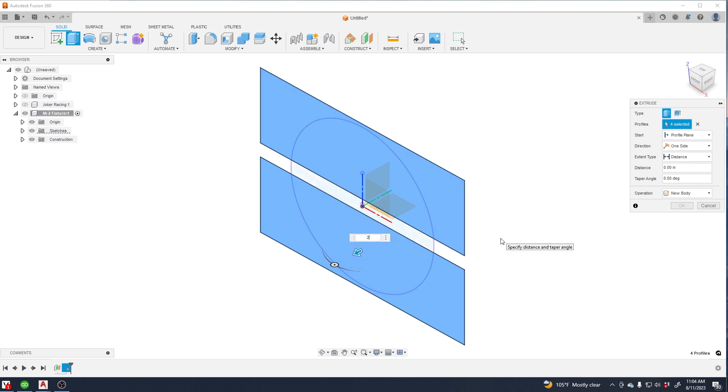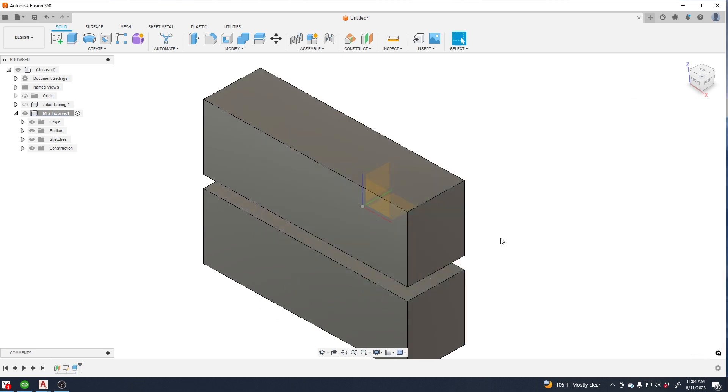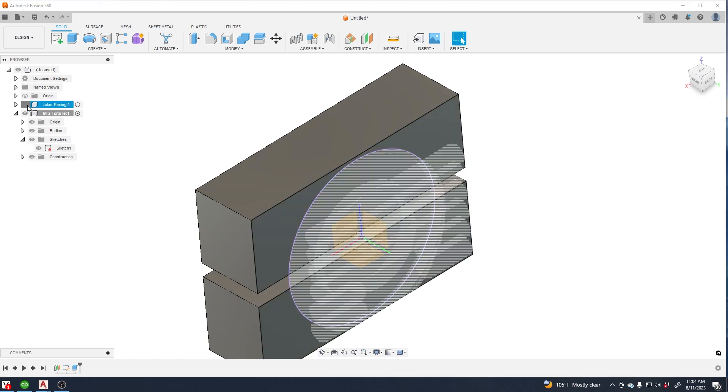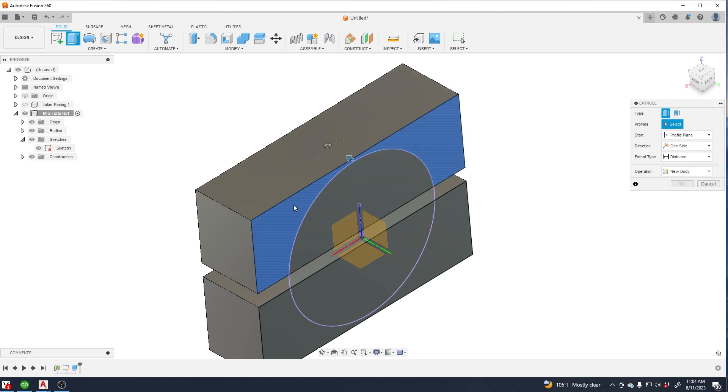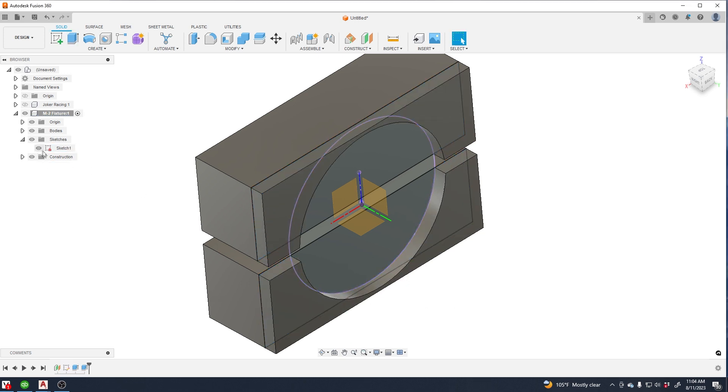It's a two-inch jaw, and the part is going to sit in 300 to 325 thou. Then just extrude the cavity the same distance as the jaw depth you removed from the back, and you're basically done.